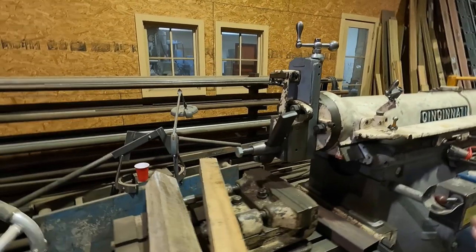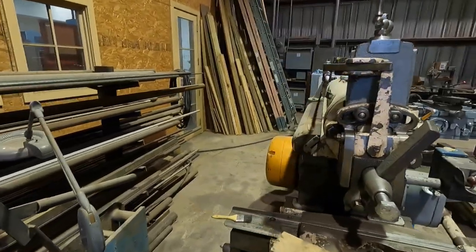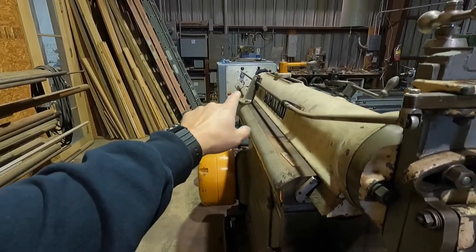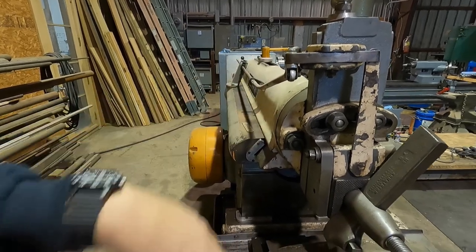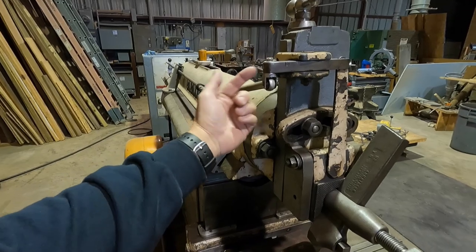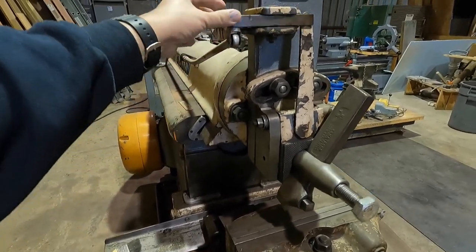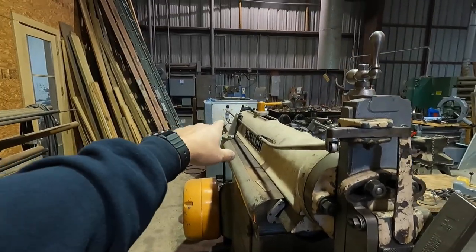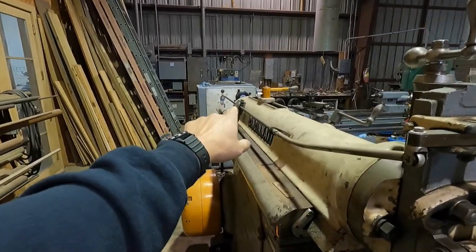And he's got where it kicks the tool up. It's the automatic tool lifter, and this is the one for Cincinnati right there. I love that he's got this because I could copy this design and put it on mine one of these days. Every time it retracts, this rod actually pushes forward and lifts the tool. See that right there? It's got a little drag device inside there, like a brake shoe in the back.